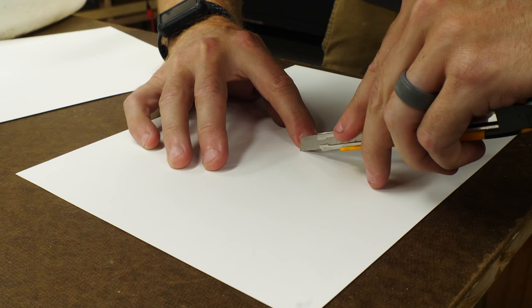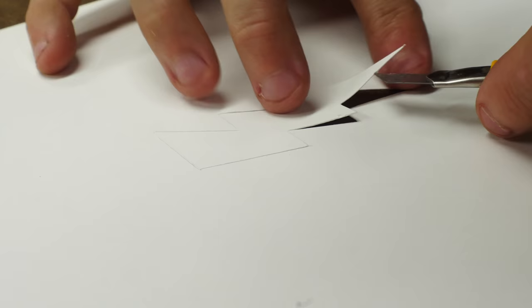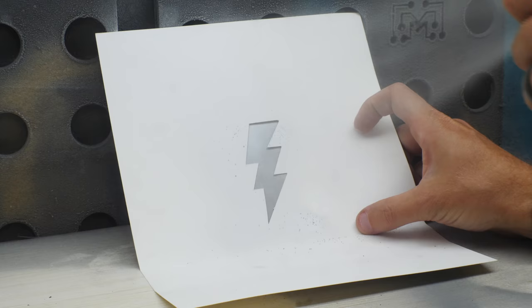If you're working on a metal project, you may have a little more difficulty putting your mark on it, but screen printing has worked out really well for me. You could go through the whole process of making a screen and printing onto the metal, but you could also just make a stencil out of cardstock. Use an X-Acto knife or a plotter to cut your logo out of cardstock and use that as a stencil. You can spray paint, dab on some paint — there are a lot of different options. Once you've got the paint on the metal, you definitely want to seal it. You can cover it with any kind of varnish, and we actually had a whole video on different varnishes you may want to check out.